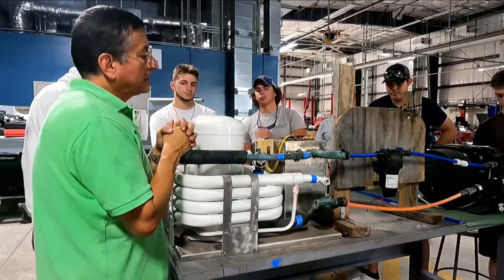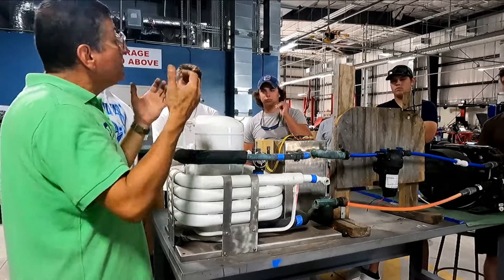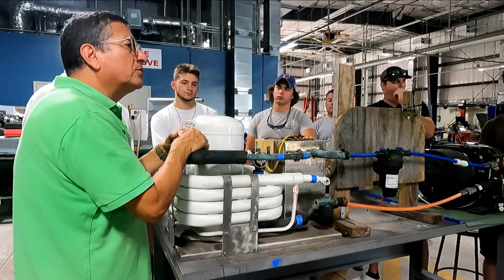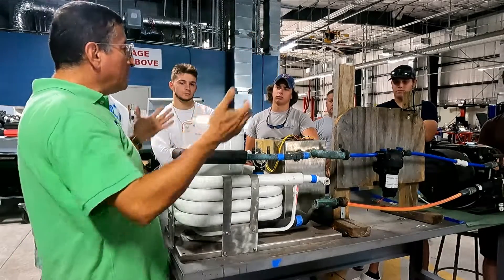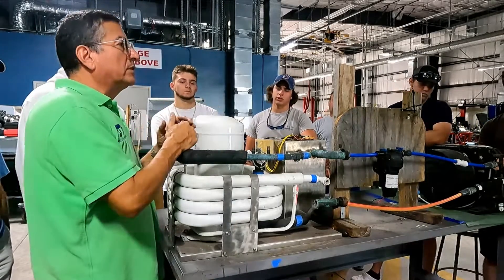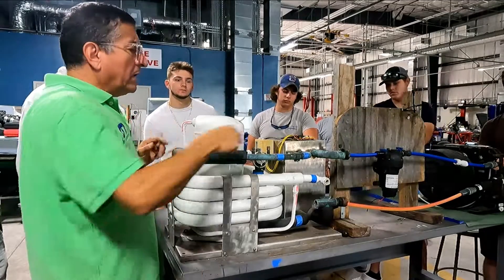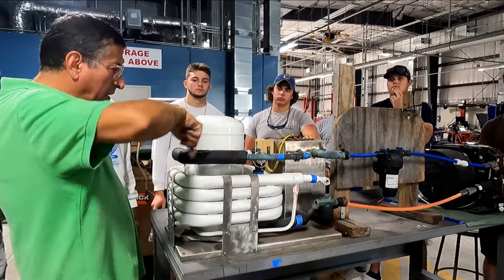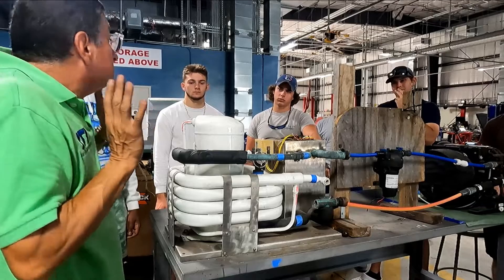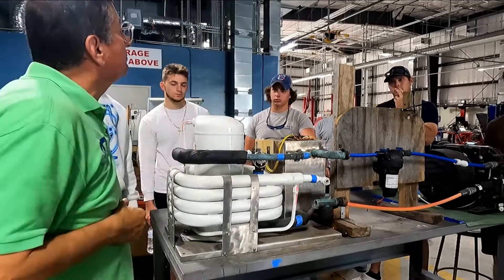How is the process to start the air conditioning unit in my boat with the boat out of the water using a cooling tower? What is the recommendation — start the unit first and then the cooling tower, or start the cooling tower first and then the unit? Start the cooling tower first. What happens if the raw water is circulating and my equipment is off? No problem — the unit is off and the raw water is circulating; no problem.